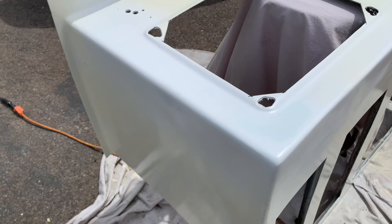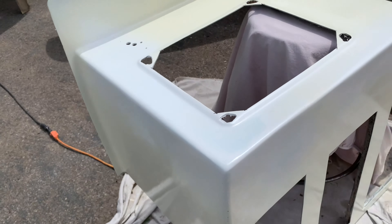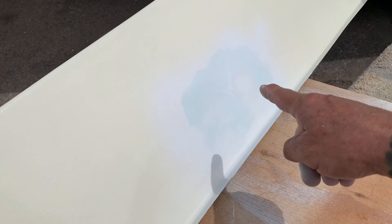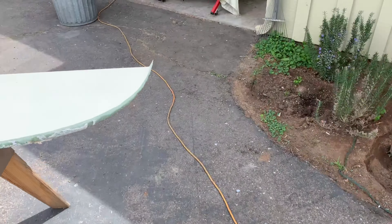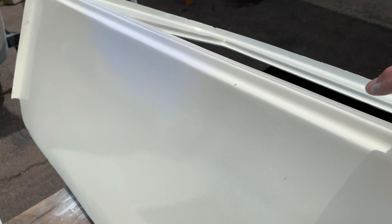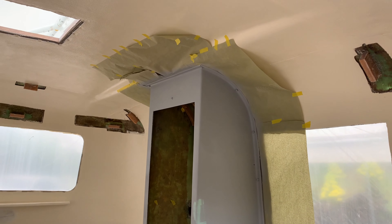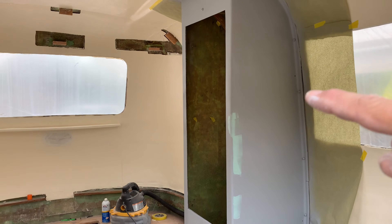I painted all the cabinets yesterday and there were some little pinholes that popped up. What I did was fill the pinholes with glazing filler, sanded it, and put some flat white primer on. Now you can't see them. When I paint the second coat today, I also did some touch-ups here — there was a little spot there, and here — where I used the Vitex filler, and primed it with white primer so it'll look nice when painted. The inside cabinet I was able to get all papered off, did all the body work, and primed it.